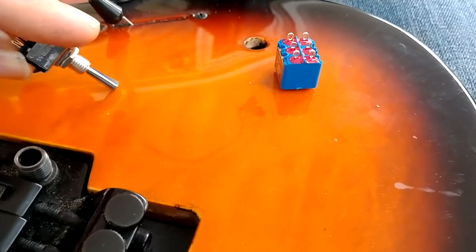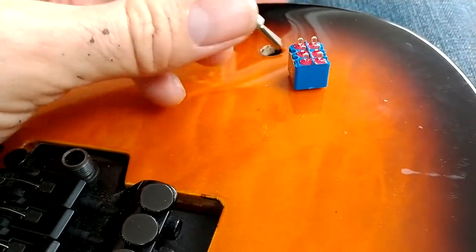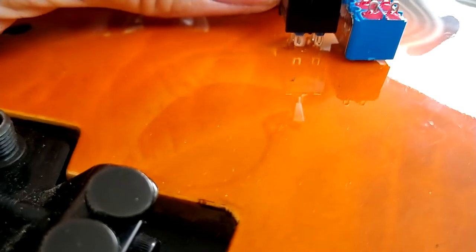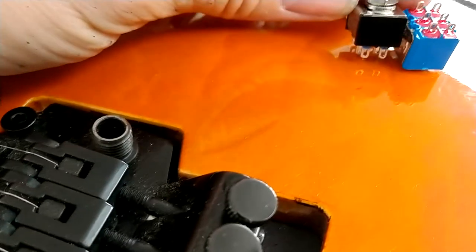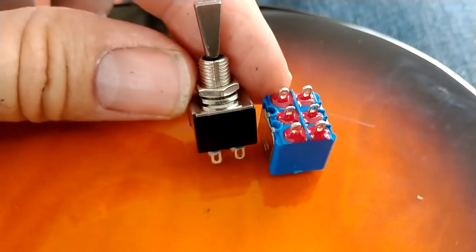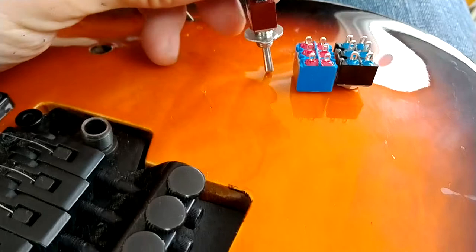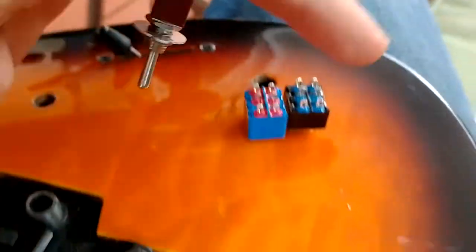Here's how I'm measuring: using the faint pencil line to find the space between here and here, keeping the same angle. Now I'm putting the guitar upside down so I know exactly where my space will be on the back. I need to find center, leaving a gap. I already had a dot where I was going to start drilling, but I'm glad I filmed this so I can reposition it — making sure I'm not going too far out and losing the space I routed out. Two holes are a little too close together; I should have stayed with what I said earlier. I'll move the final one over a bit since I have more space in the back. Now I'm drilling from the top down since I already have the first initial hole done.